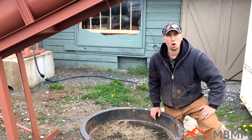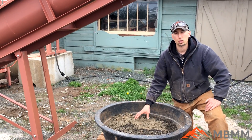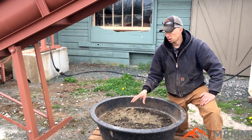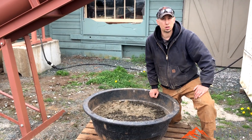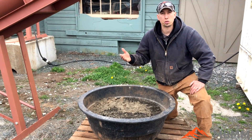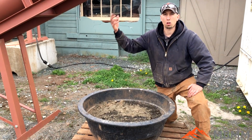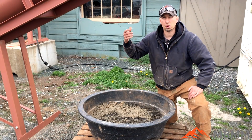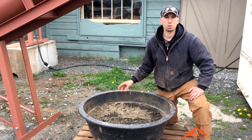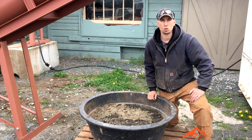It's nice, it's dewatered, and it's ready to be either disposed of or, if there are still appreciable values in here, you can run it back through the system to grind it finer. That's one of the ways a lot of our customers achieve a 100, 200, or 300 mesh grind size — the spiral classifier will auger the larger material out of the ball mill or hammer mill so it can be rerun through the system to get the desired grind size, and only the finest 200 or 300 mesh material will go out to the tailings pond.